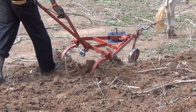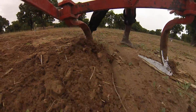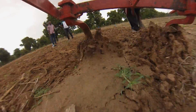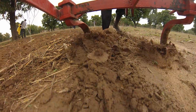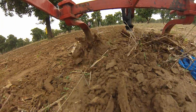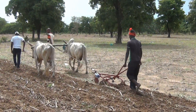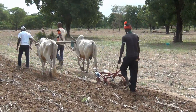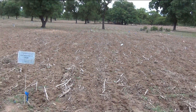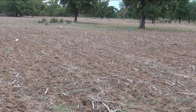Innovations to improve weed control and cultivator performance in the zone tillage system included working with local blacksmiths to build low-crown, low-pitched sweeps for full row root cutting at a shallow tillage depth. Here we are using the row cultivator pre-plant for early season weed control in soil made mellow from recent rain. We then planted directly without using the zone tillage tool or any additional tillage.